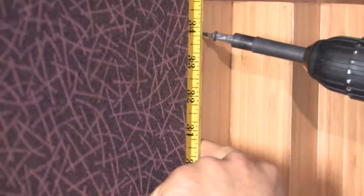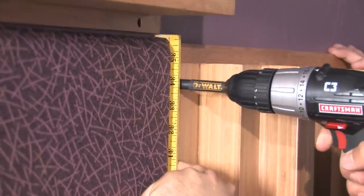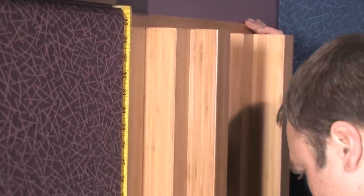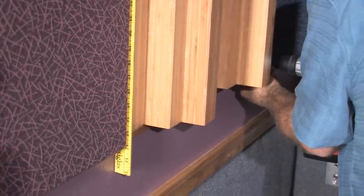The sustained diffusion series comes with pre-drilled holes for mounting. If you are screwing into drywall, you will probably need to install plastic drywall anchors first, then fasten the screws into the anchors. Then finish up by adding the supplied hole covers to hide the mounting screws.